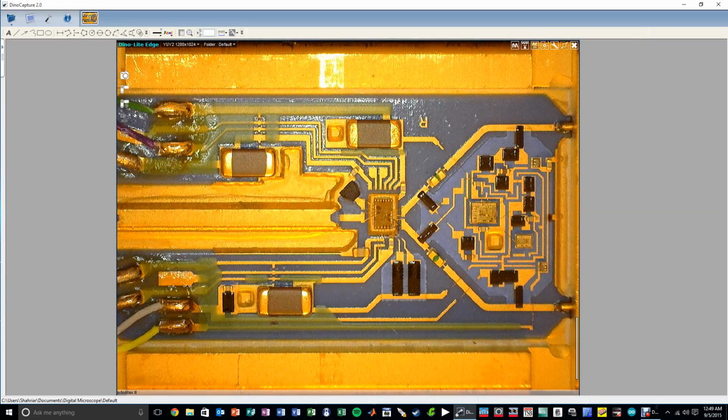But this is actually a two-path. To me, it looks like this is a two-path, a high-speed path and a lowest-speed path. The lowest speed path, which is the biasing of the probe, comes through here, through this whole bunch of circuitry, which then biases the input common mode voltage of the indium phosphide chipsets. And you can do this by creating this two-path and compensate the frequency response and all that, in order to AC couple the input of the indium phosphide chip so that it doesn't have to see the large range of voltages.